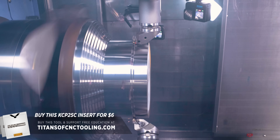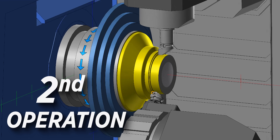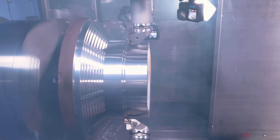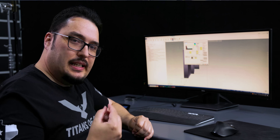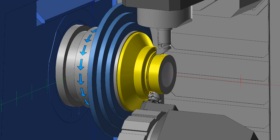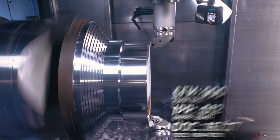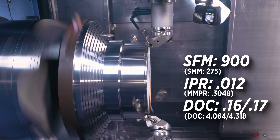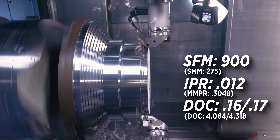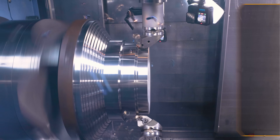For the second pinch turning operation, it's going to continue from that point, going to 140 depth of cut and then up to 200 thousandths per side. That's in increments of 10 thousandths per tool: one tool doing 30 thousandths, the other doing 40 thousandths, then switching — 50, 60, 70 — all the way up to 200 thousandths. I'm going to be taking this at 900 SFM with a feed rate of 12 thousandths on both operations, both tools, keeping those numbers for the whole operation. This tool is going to be hauling.